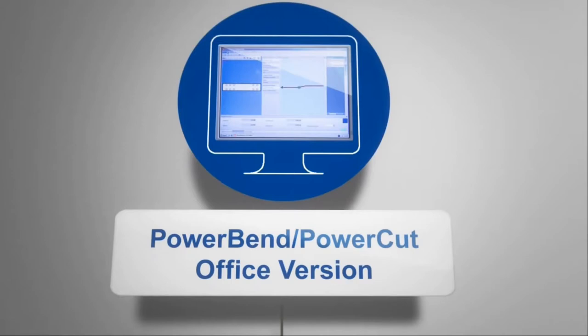This is a key element of the EHRT solution. We have the power bend software, which is your bending software, ties to our machines, which also complements and ties to our punching machines. So with a full solution of this machine software, the office software mimics this, which allows engineers in the office to actually program the parts and let your operators run your parts. Really just depends on the facility of how you guys have it set up, but the ability to have the same software in the office and the machines and tied together on the network really sets EHRT apart in the operation of the machines.